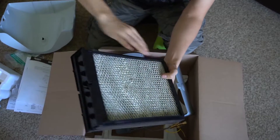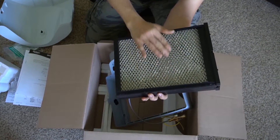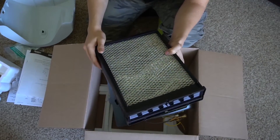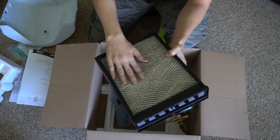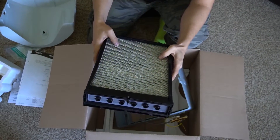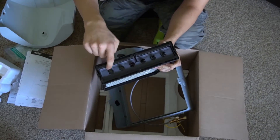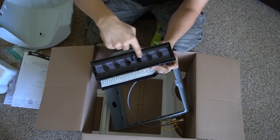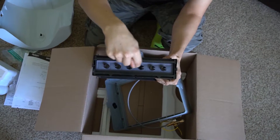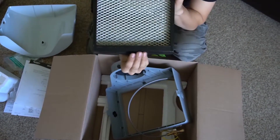This is just the frame. I believe this is a size 35, but you can just go to any home improvement store like Home Depot, Menards, or Ace — tell them you have an Aprilaire 600 and they'll be able to give you a new one. Should be about $20 to $30 and should be replaced annually, depending on how bad your water is. Here's the water distribution tray — water comes in here, flows all over, goes into every hole, and then trickles down this panel and drains out the bottom.